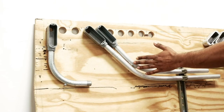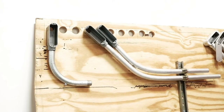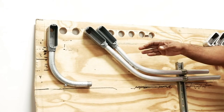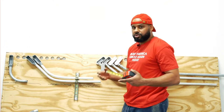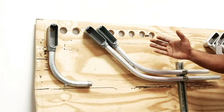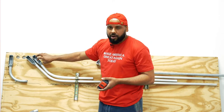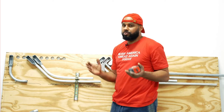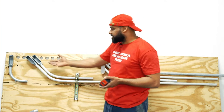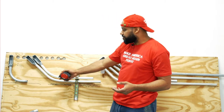In this other illustration you have two kick pipes using the LB. Some will argue you could fit more pipes by turning the LB more, but we as electricians like to run our runs tight to use less width. The more you turn the LB, the more width you give up and the more you open up your run. So we usually don't run it like that — typically the most you'd turn the LB is about 30 degrees.